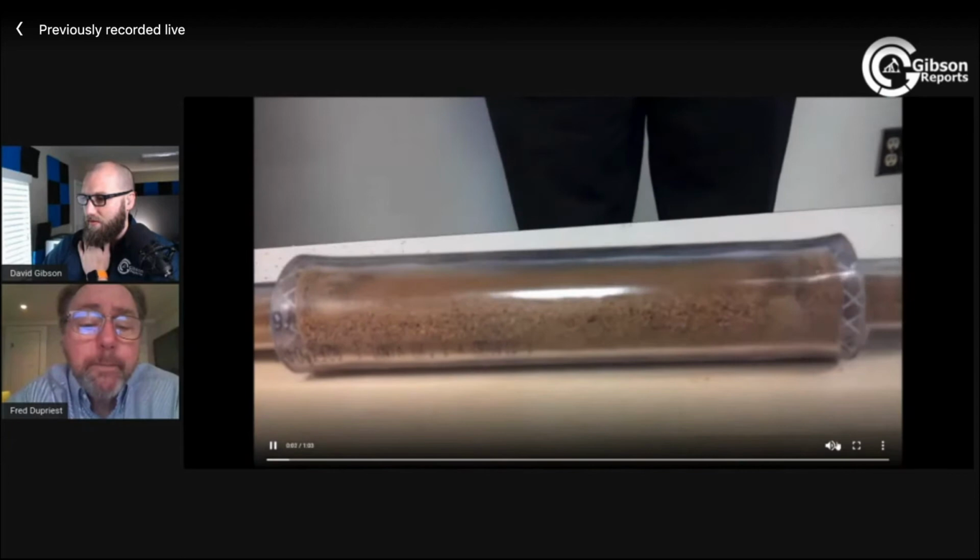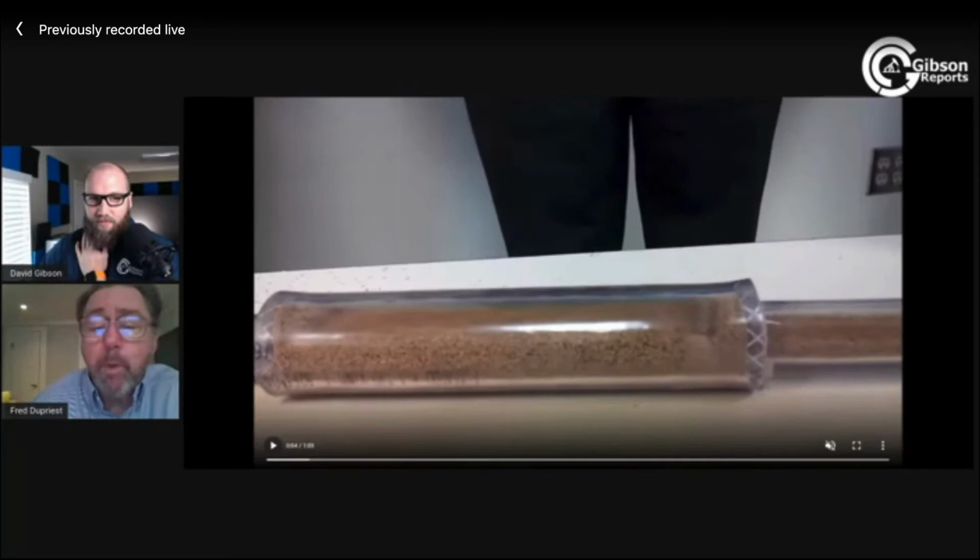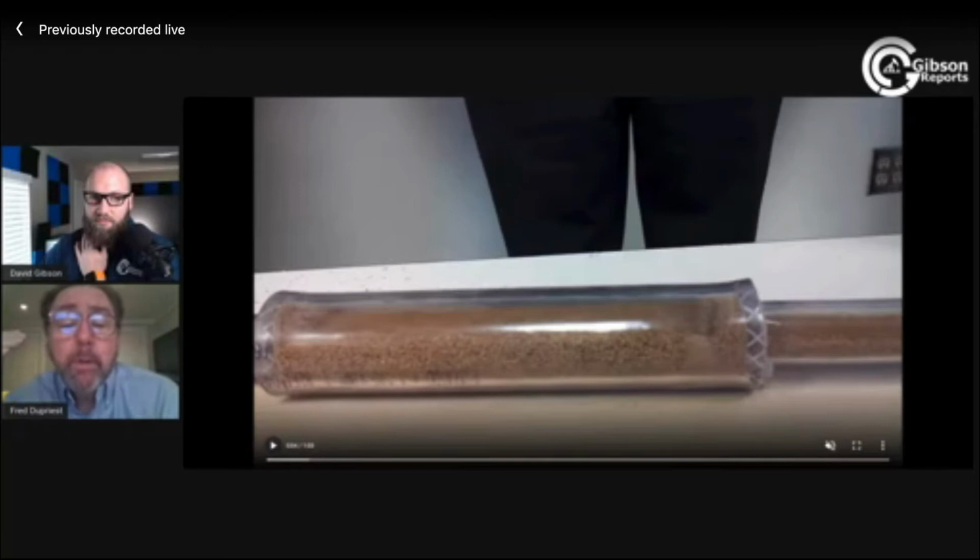Okay, stop. Now, watch the bottom of the beds here and here. That's my equilibrium bed down here. This top part is the transportable layer. That bottom is never moving, never, ever. It's just going to be there. What we're going to do here is stop drilling in a minute and just circulate. And what you're going to see is the top will come off because it's actually sticking up above the equilibrium height where I can roll things and can't roll things. What can be rolled will roll. So it'll come out of the hole, but that doesn't mean your hole is clean.